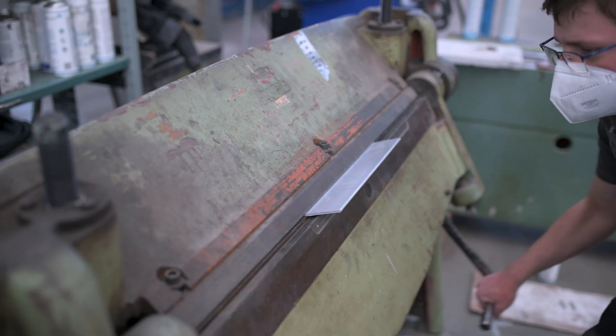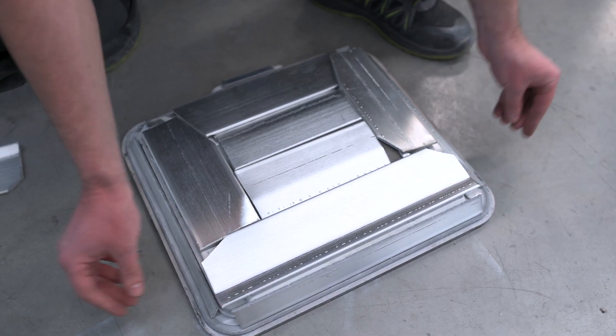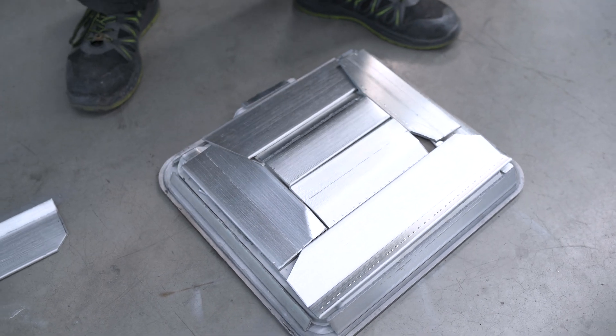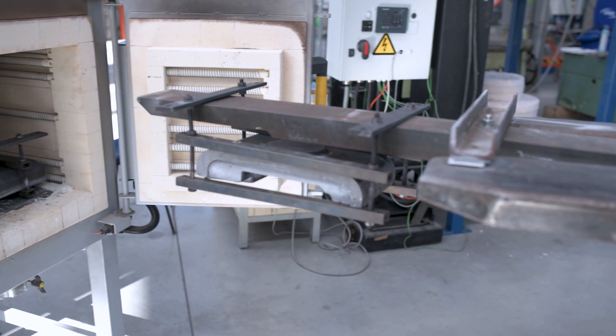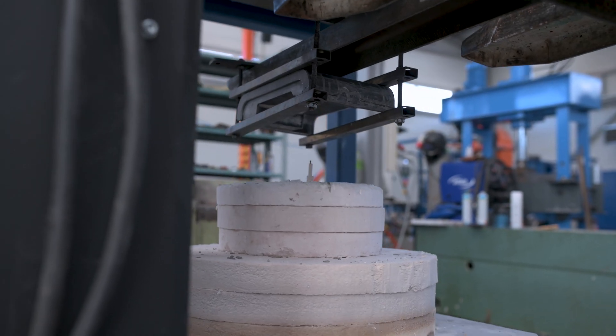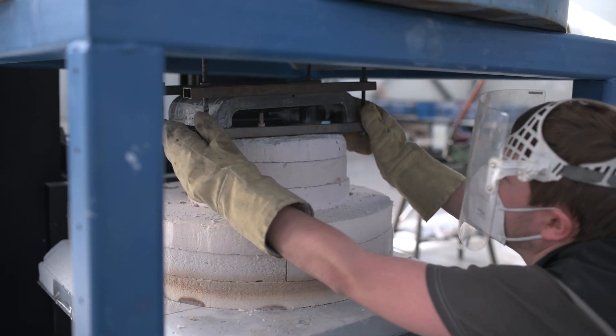The profiles are cut and shaped to fill the mold space as much as possible. Next, the mold is closed, placed into an oven and heated to about 550 degrees Celsius. After the temperature within the mold is homogenous, the mold is put into a foaming oven and heated to about 680 degrees Celsius.